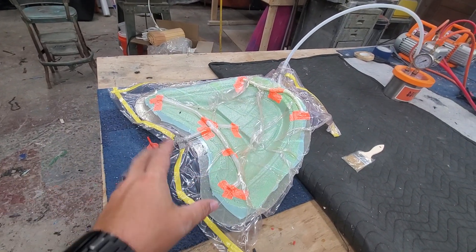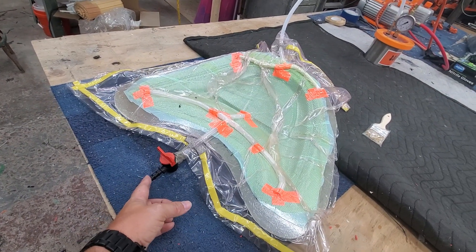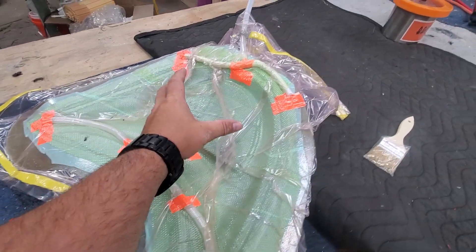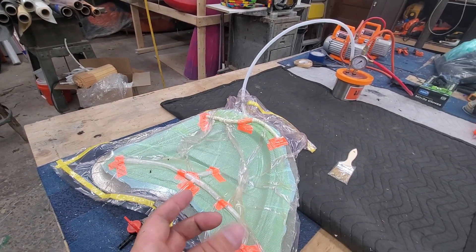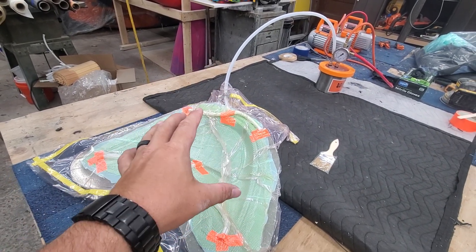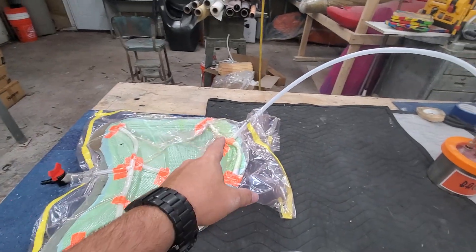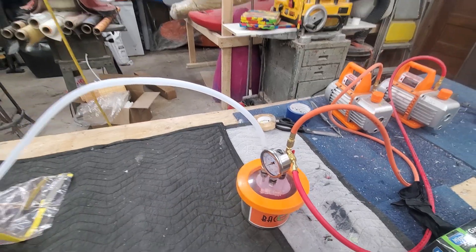Why is there a foam core? We don't want this thing to sink — easy way to prevent that. I make these out of scraps. What's going to happen is I'll connect a hose here, the resin comes from a pot, gets sucked in, distributed across, migrates through, and when it hits this white ribbon right there — basically like Gore-Tex — it gets stopped. It'll run end to end, soak out under lots of pressure, and the part will be as light and strong as possible.